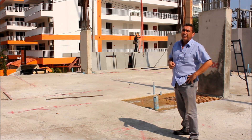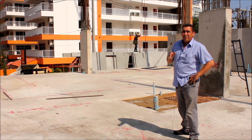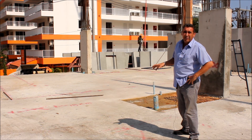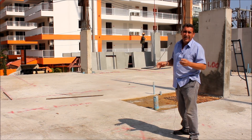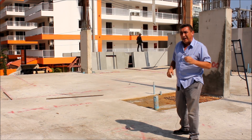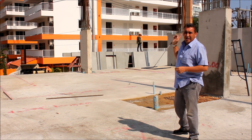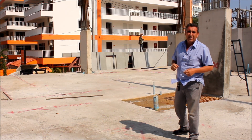We're unloading the first of the panels from the back of the truck. We've got the tower crane in position, but I can't just put those in an open area. If we grouped all of those walls together as a storage area, it'd actually be too heavy — it would break down through the floor. So on the backside we've had to create a framework as a holding area for the walls to go into first, until we crane them into position.